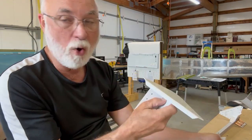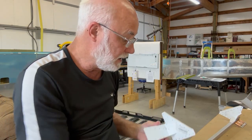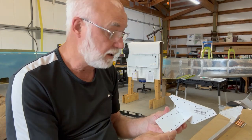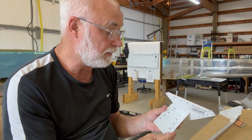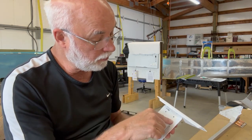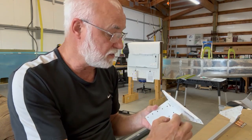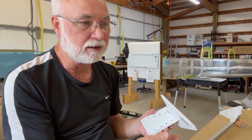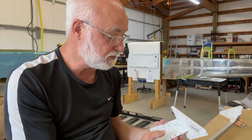When the bolt goes through this hole, it has a lot of friction, and I will drill the lower longeron and the spacer at the same time. To torque it, the way to do that is you put the bolt in the hole and you use your torque wrench to find out how many inch pounds it takes to turn the bolt without a nut on it. And let's say it's going to be 5 inch pounds and the bolt's supposed to be torqued, say, at 20 inch pounds. So then I will actually torque it at 25 inch pounds to get the nut snugged up properly.